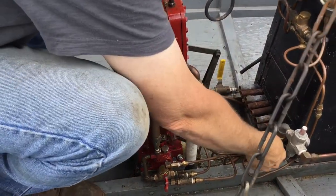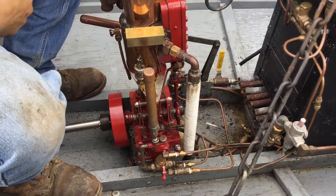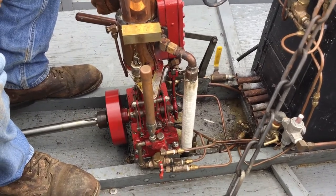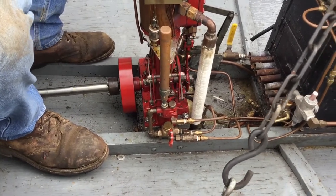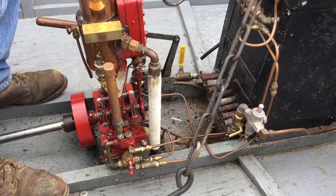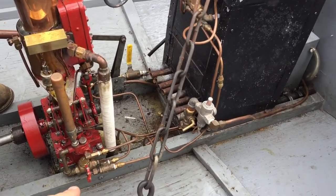Is there a slip eccentric in there? It's a bronze slide valve in there, and there's some slop in there — like that much. When you time the engine, if it ever goes out of timing, you have to time it to like maybe two degrees past the opening of the slide valve where it just cracks open on top dead center. So when you bring it two degrees over with the crank, you'll see the slide valve and you can make an adjustment — lengthen it or shorten it up.